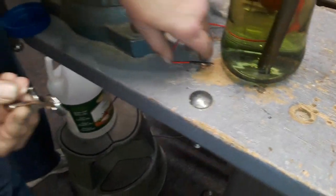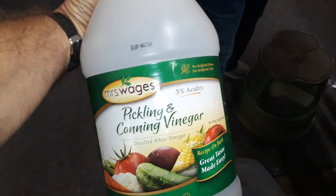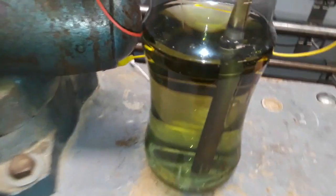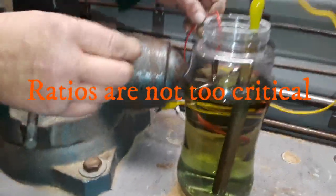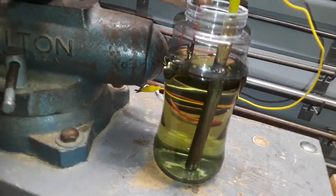We're going to strip this using distilled white vinegar, as opposed to apple cider vinegar. There's a tablespoon of canning salt in there — no iodine in the salt — and then just a five-volt power supply. So really we're reverse plating this.